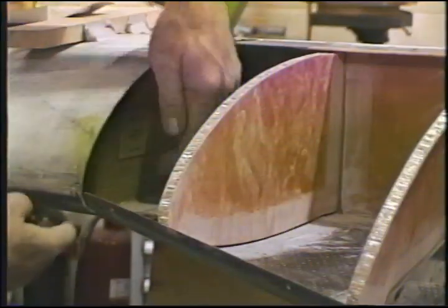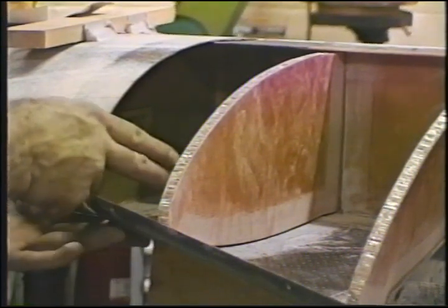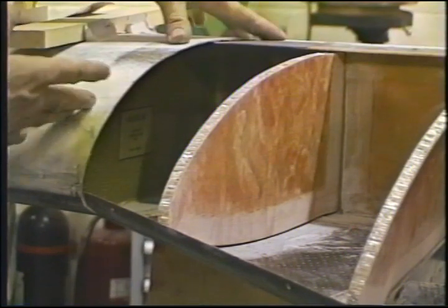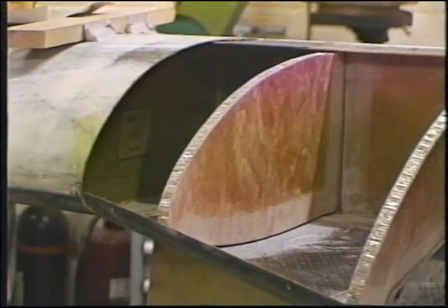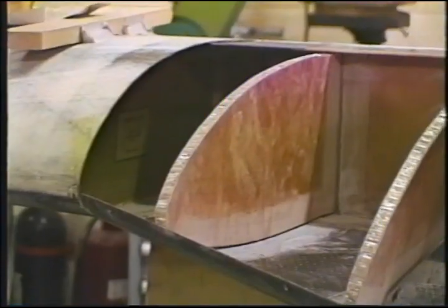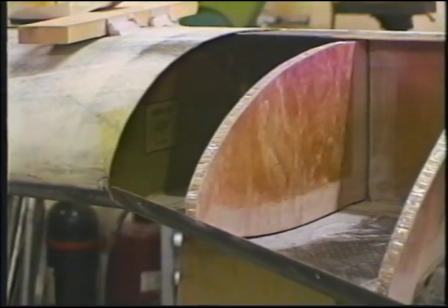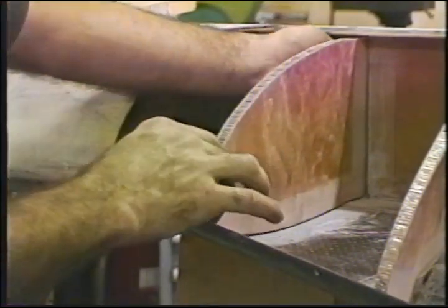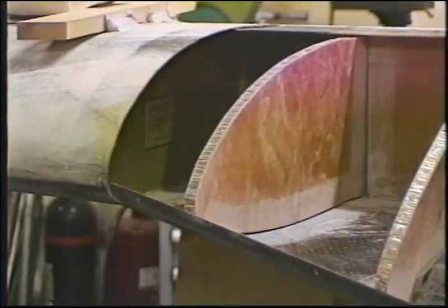It'll be cut to the rib shape here on the end, so it'll sustain the outboard end of the Strakes position relative to the wing, so that you don't have to have the wing on here to prop it up. I don't know if you can see the prop underneath. Yeah, there's that prop underneath. It's a piece of wood down below. We've got it propped up. Well, that piece of plywood in there will negate the necessity of that. And that holding position while you put these ribs in place with the wing off gives you much better access to all this stuff.